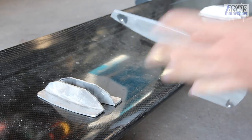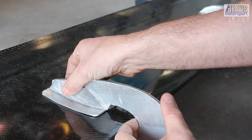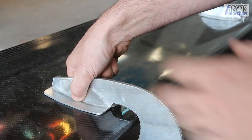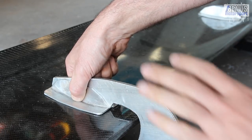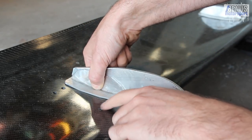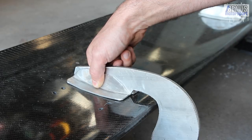We've got our swan necks — I've split them apart now, they were previously bolted together. The shape is all pretty much done and we can bolt them up together as needed. These will sandwich in between the brackets we've made up. Everything sits more or less flush and just needs to evenly position between our four holes. We need to drill holes into these, and like I did with the bottom side, I'll Sikaflex this bracket down as well for extra added strength. The holes need to be pretty much on point, so the easiest way is to do a bit of math — work out how far apart everything is and the distances between them all, then mark and drill them out.